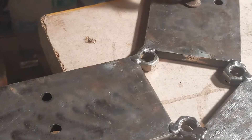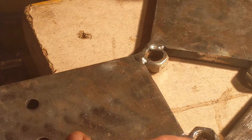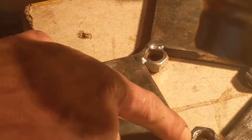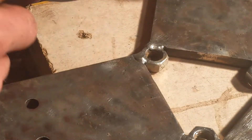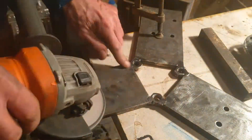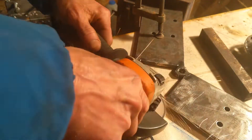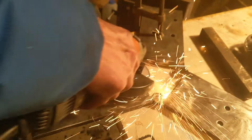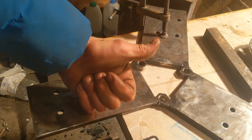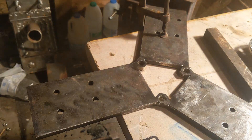Yo, what's up — I got this welded up how I wanted to with the stick welder, everything's good. That's all flat, and now what I've got to do is flatten off the weld so that this surface can be the one that mates with this surface. This side needs to be perfectly flat, so I'm going to get the grinder and do that. Got my mask on so I'm talking a bit funny — let's see how it fits up.